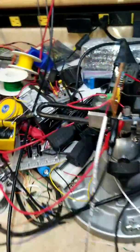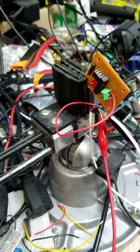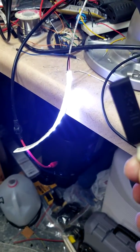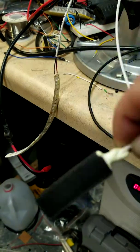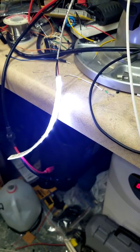What this circuit does is it delays the starting of that voltage going out to the LED strip. So if you watch this, when I turn this over you're going to see that there's a slight delay in that light coming on. I have it programmed for about three quarters of a second, and that's going to act as a filter.